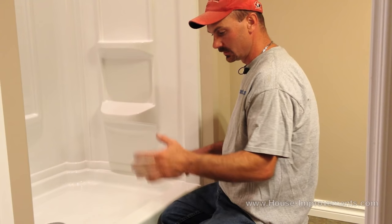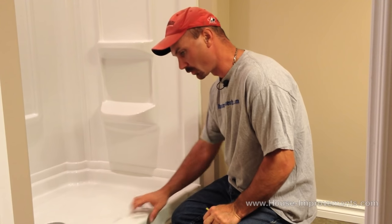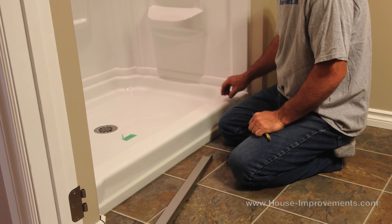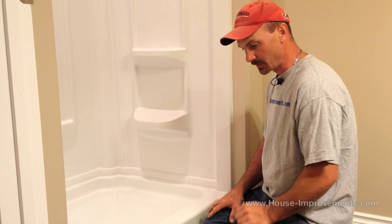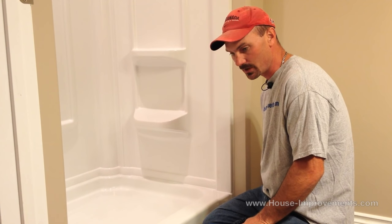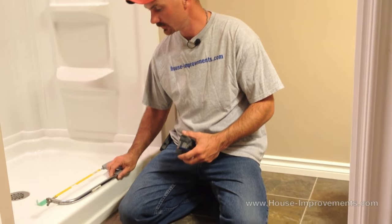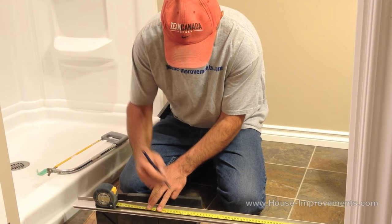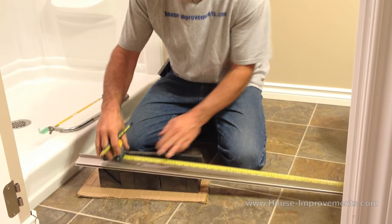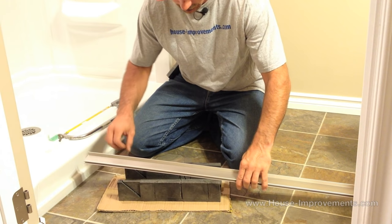Once we have that cut we can lay it in here in place and find our placement in and out. This shower base has got a little bit of a profile on the bottom, so we have got to make sure we have everything lined up so that we are sitting on a nice flat surface and the sides are going to match up on the flat area as well. The next thing to do would be to cut this bottom track, so I am going to grab the miter box and the saw. I have got the miter box and the hacksaw here. I am just going to mark my measurement which was 44 and 7 eighths right on the track. Because we are using this miter box it kind of guides us to be straight, so it is not necessary to mark a line with a square. I am going to line that up with the straight slot in the miter box.